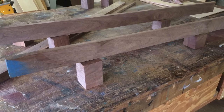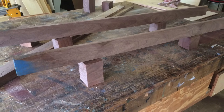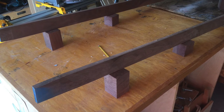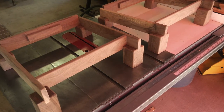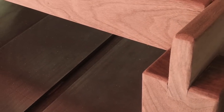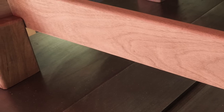That's for another set of speakers the same guy has — he has some high-end JBL speakers. He said, 'Can you make me another set?' I said sure. He said, 'I want them to look different — you decide.' So I said okay, I'll decide. We laid it out, we knew the dimensions of the base of the speaker, and he wanted five degrees of angle on that again. So we laid it out to figure out where we needed to be, then cut it all and shaped it all. This is walnut again. We ran dados inside our posts to bring these things together. Here you can see the dado with our side rails tucked inside of them. This is before we put the finish on.